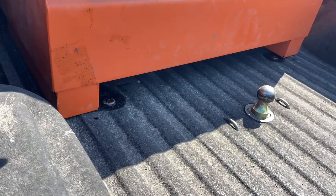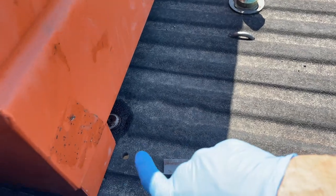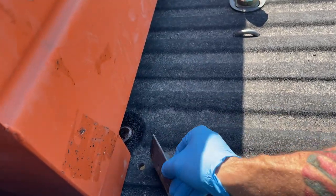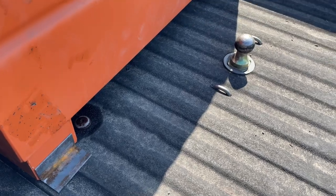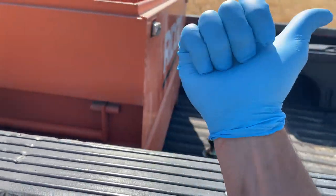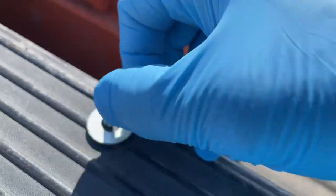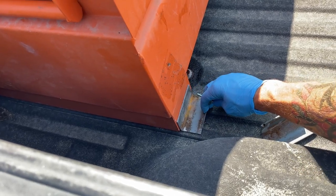So now my final plan is this. I cut me some angle iron, and we've got one hole and one hole that kind of — they don't really line up with this — but one bolt will hold this. Basically, you're just trying to keep the thing from bouncing around. So that should be more than enough to hold it there. I could put it bigger than a quarter-20 here, and quarter-20s here, thread them in. That'll be strong enough.